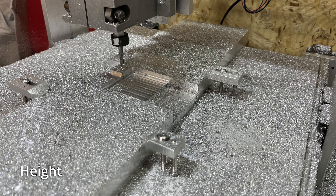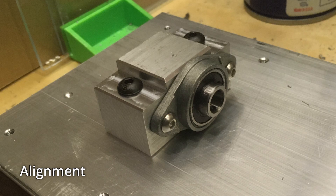You could also handle the height difference by adding spacers on top of the linear bearing blocks, but then you're making the axis higher and potentially creating more of a lever arm for the forces against the linear bearings. With lead screws — especially those 8mm ones that are pretty bendy — alignment is more forgiving, especially with flange mount bearings that have a lot of adjustability built in.